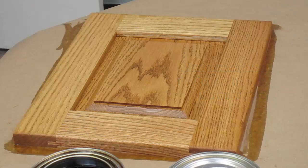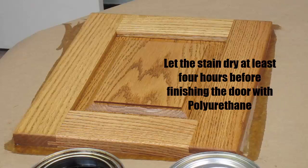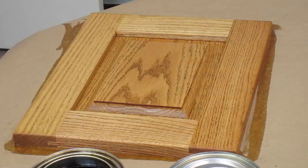The drying time for Minwax stains is usually a minimum of 4 hours, but it's a good idea to allow more time, especially in lower temperatures or times of higher humidity. I usually wait to apply the polyurethane the next day. After the stain is dry and all the stain seepage has been wiped off, it's time to apply the protective finishing coat, which is covered in our next video.